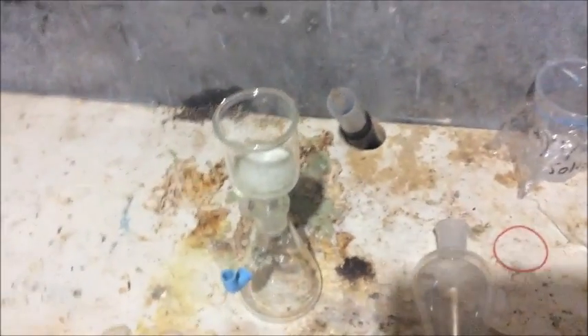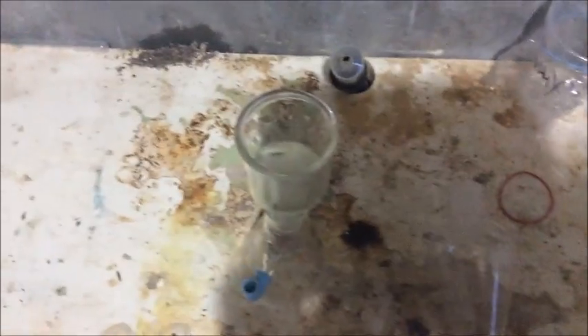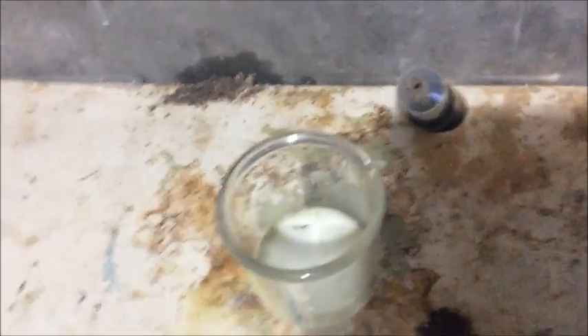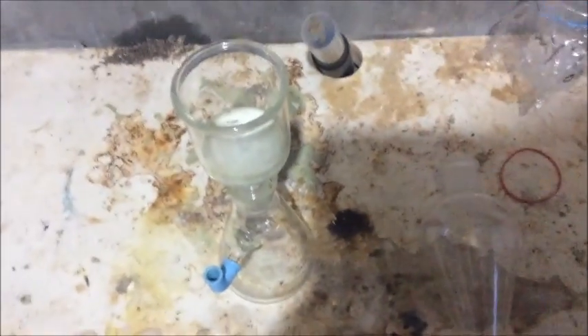If you can suggest a way to try and remove it, I'd love a suggestion — I don't actually know what it is. Perhaps it's some silver that has gone in there as a nitrate in the middle of the sinter and then decomposed, because I think it's set a little bit below the glass, like inside the glass somewhere — it's not sitting right on the top. But I think this is pretty organic-contaminant-free now if it's had the hot chromic acid through it.